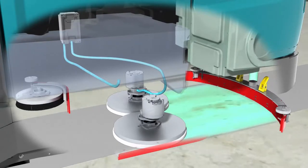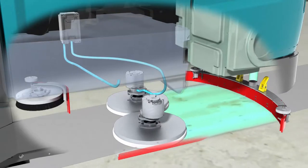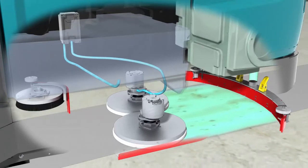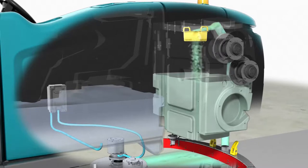To scrub the floor clean, the desired amount of cleaning solution is regulated and distributed to the floor. The brushes use the cleaning solution to scrub the floor clean. When traveling forward, the squeegee collects the dirty solution. The scrub vacuum fan draws the dirty solution collected by the squeegee from the floor and puts it into the recovery tank.